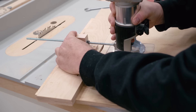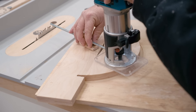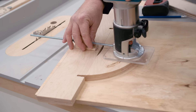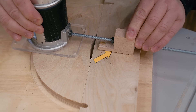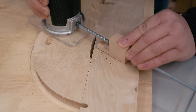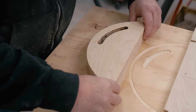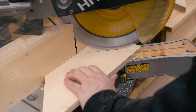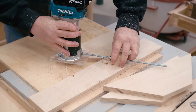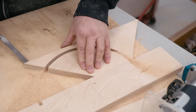I have all three cutouts done. I've reset my circle jig to cut the adjustment slot, and I'm doing this with a half inch bit because it's a three eighths inch bolt that goes through it. The slot starts and ends in specific places, so I made a couple of marks on the plywood that will line up with the pivot block on the circle jig. With the adjustment slots cut in all three, I can move on to making the cradle for the trunnions — once again that'll be three quarter inch plywood. I can pin those in place, being careful not to put it where I'm going to be doing the cutting, and with the circle jig fine-tuned to exactly the right fit, I can cut all three.